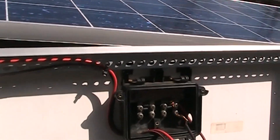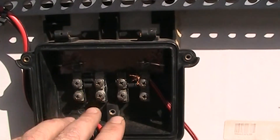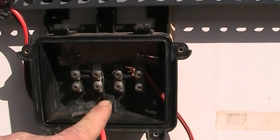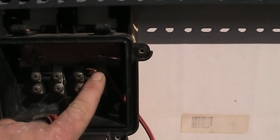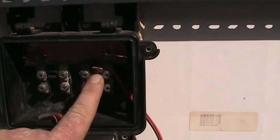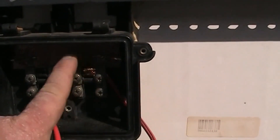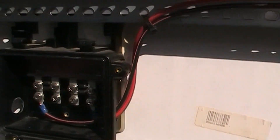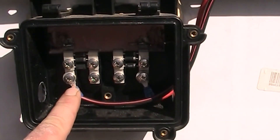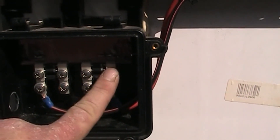I had already had some of this wired up, and Bill just told me that I had made a mistake in my wiring. There are two sets of screws on each one of these. On the top section there are the blocking diodes, which keep the current from coming back through into the panel and only keep it going one way. I had mine wired up where the diodes are, and that is incorrect. I need to put it down on the bottom screw so the top screw can hold those diodes in place and make sure they have a good connection. This is incorrect wiring, and I also didn't use any kind of ends — I just had them wrapped around, which is not very efficient. The correct way is to wire them on these bottom posts on the outside using clamp-on ends, so the diodes have good connections on their bars.